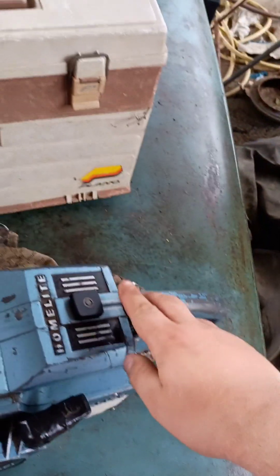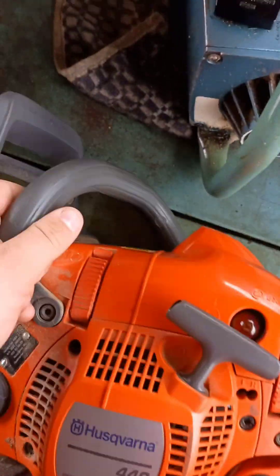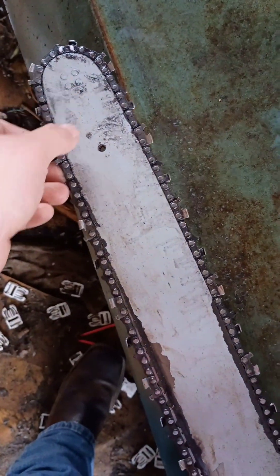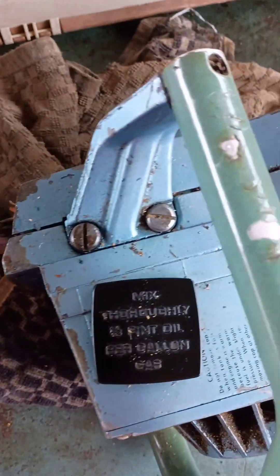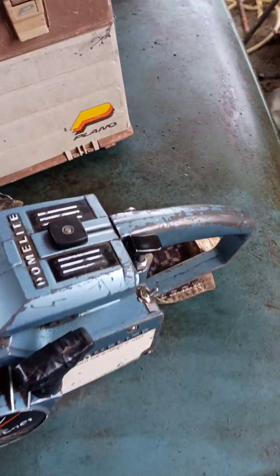This little thing here is an oiler for your chain. Newer saws have an automatic oil system — there's a little pump inside that, when the chainsaw is running, causes a gear to spin and pump oil onto the chain. It comes out of one of these holes and keeps the bar lubed so it doesn't seize up. Back then you had to do it manually — you had to pump it. You can see the oil coming out right there — I put some Husky oil in here. You can see it oiling the chain. If you forget to push that, it's going to seize up and probably throw sparks.